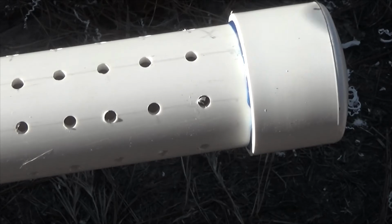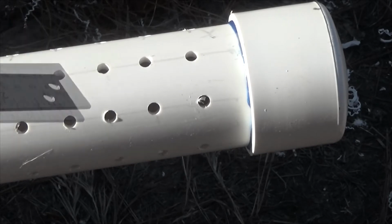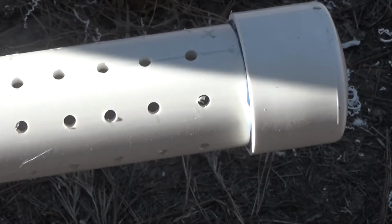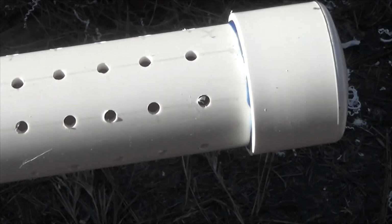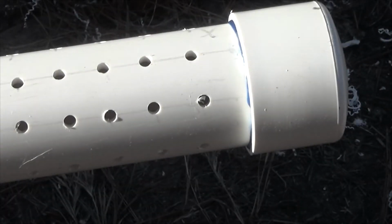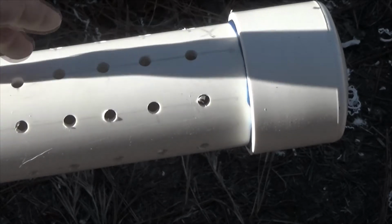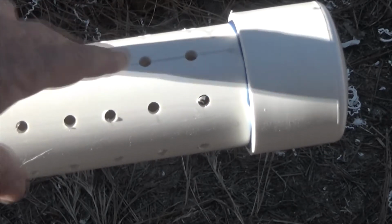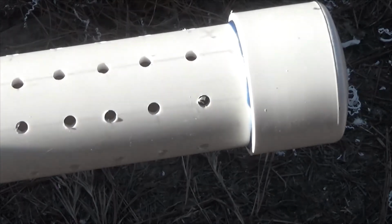So now the next thing to do is to cut the stainless steel mesh. Although I worked the math many times, I rolled out a piece of paper. You see the pencil marks? That's 9 inches from one side to the other, which agreed with the math I did. So this will be 10 inches so that I have an overlap, not a seam that I have to close down, and then I'll come back and pop rivet this into place.